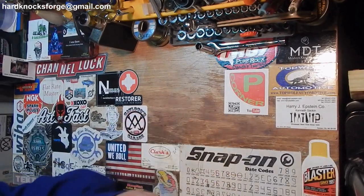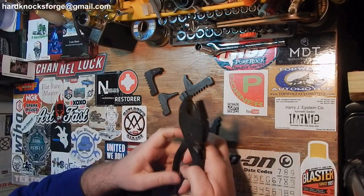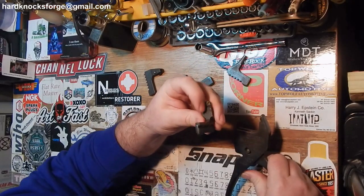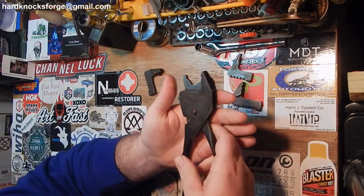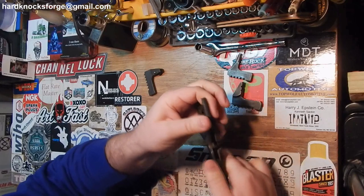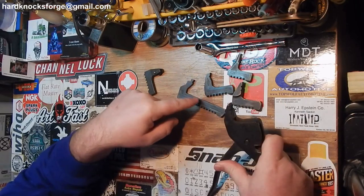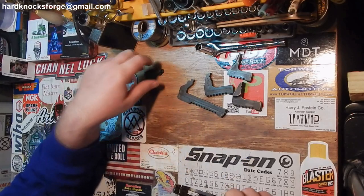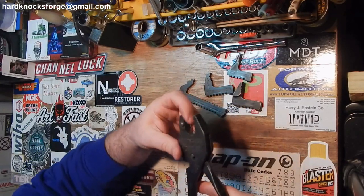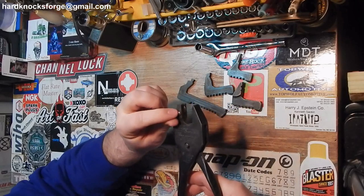I also have another mail call — he wanted to be anonymous. He sent me these old Eiffel plier wrenches. This is a five-jaw — it's got the needle nose and of course the regular old jaws; nice cross-hatching on this. This is a really good Eiffel pliers set. This is the pipe wrench — got the old curved jaw there for grabbing pipe. This is actually an extender — these go in the other way and you can grab on the inside of a piece of pipe. Nice piece. This one and this one seem to be the ones that get lost out of most kits — and it is the tubing cutter. Mash her down, give her a twist, mash her down a little more, give her some more twist. Yeah, blade is replaceable.